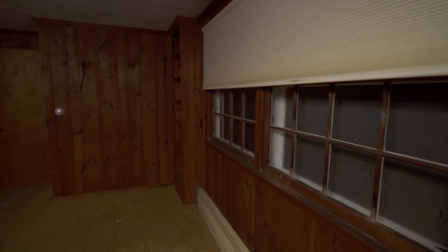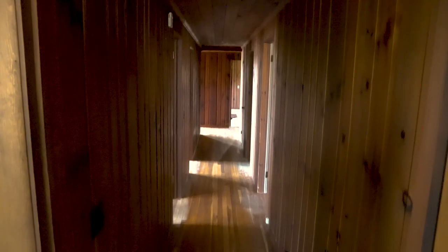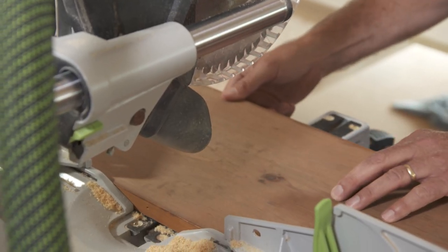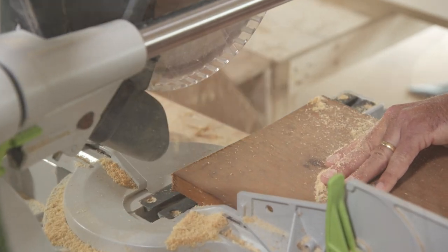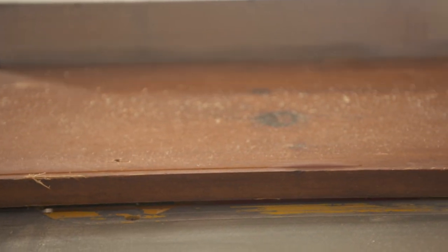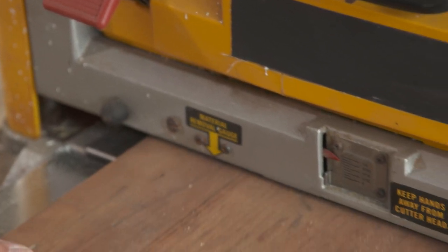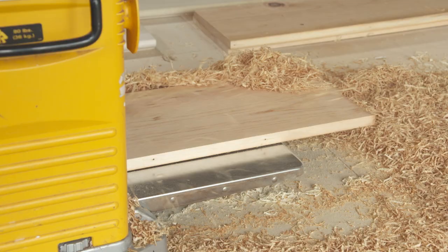You may recall that our ranch house had Knotty Pine in just about every room. Jeff and Tom saved some of it, and at least one room in this house will pay homage to that mid-century wall cover. It's a little beat up — we've got to clean up the edges and resurface it, but we're going to make it into a wainscot wall in one of the kids' playrooms. First, I'm just going to cut it to lengths we can manage. The edges are pretty beat up, so we'll run it through the table saw and get a clean edge on each side, saving as much of the width as possible. Then let's run them through the planer — this stuff has really patinated over 50 years — to clean it up and flatten the surface.